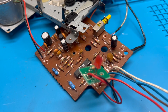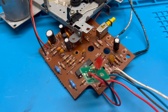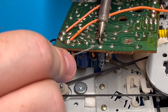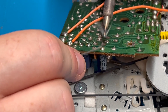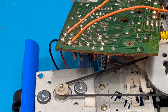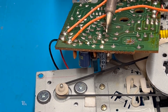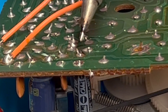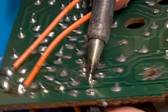I also did the same for the tape drive circuit board, which was much easier given that it's significantly smaller. With this one I decided to remove and replace each capacitor individually, given that the board is connected to the tape deck frame by multiple wires and I was feeling far too lazy to remove them all. This worked quite well — just applying a little bit of fresh solder to each joint, removing the vast majority with the solder sucker, and then prising out the old caps before inserting the new ones.